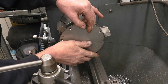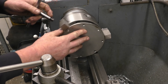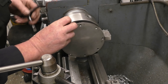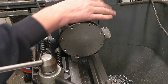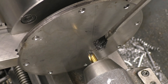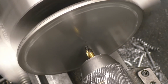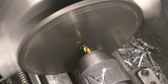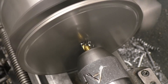I'm going to put a hole in the centre for the fitting that's going to take the gas inlet pipe. I'm going to put a 20mm hole in because I've got some 22mm stainless bar that I'm going to make the fitting out of. I've managed to find the brush so I can put some of the cutting paste on — I quite like it, it seems to be working quite well. Once again we're running slow, about 300rpm which is more than quick enough.